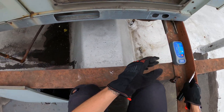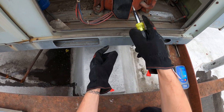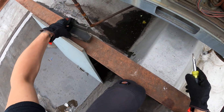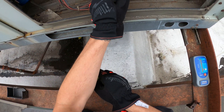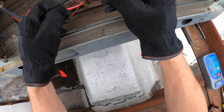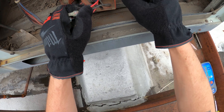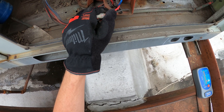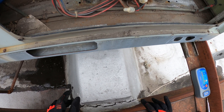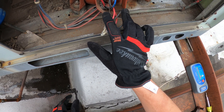Power is off — let's get to our compressor terminals. It's just a little pop out. If we look closely, there is some sort of protection on this compressor. Below here is a thermal overload, so if this compressor overheats, it will shut down. At least that's there. There's a good chance this thing runs hot, or it might have a good insulation reading — we're going to perform that test.